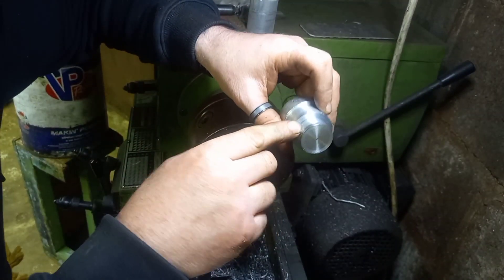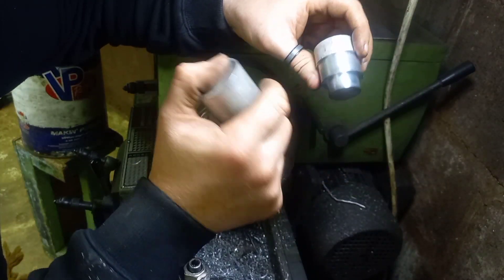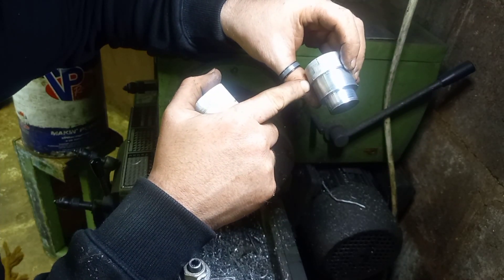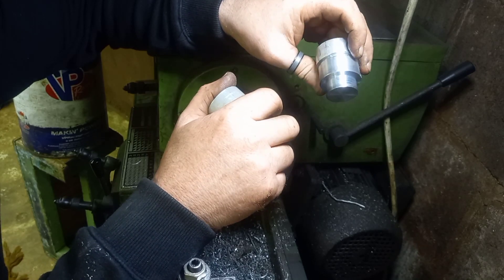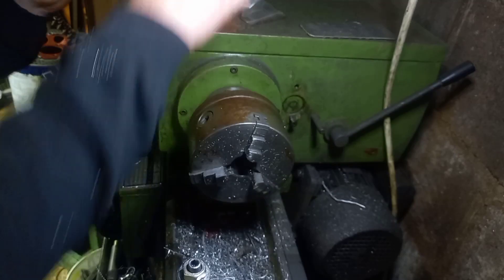So now that I've got that step machined on there, I need to repeat it on both ends of this piece and both ends of that piece. Then cut it in half - that'll give me four collars. Then I'll machine the cut ends: one for the top and the other one recessed for the allen bolt on the bottom. I'll go ahead and do that and turn the camera back on once I've got these four pieces in my hand and ready.